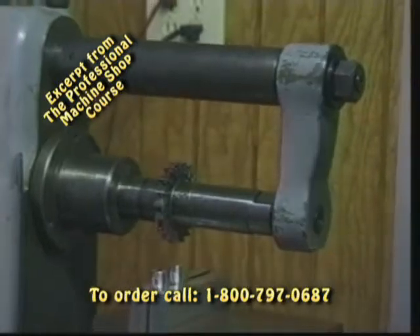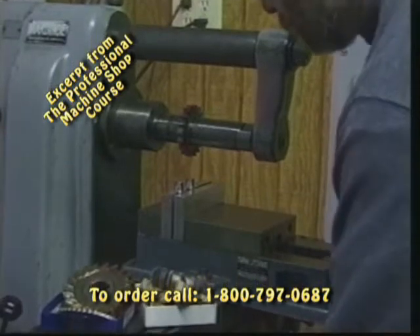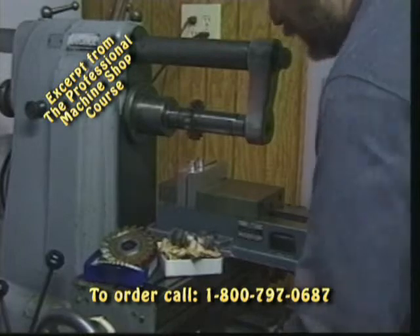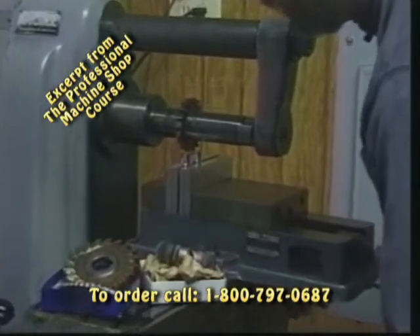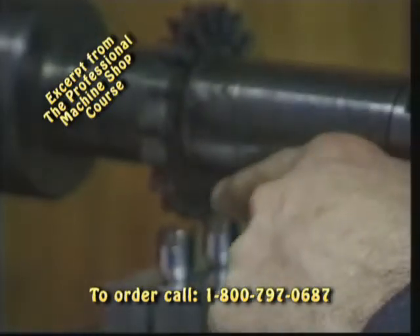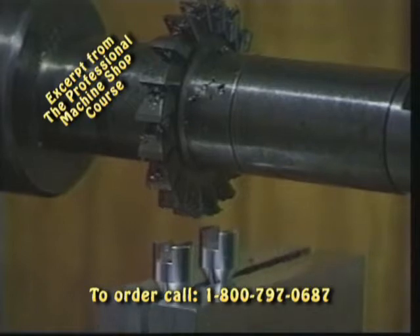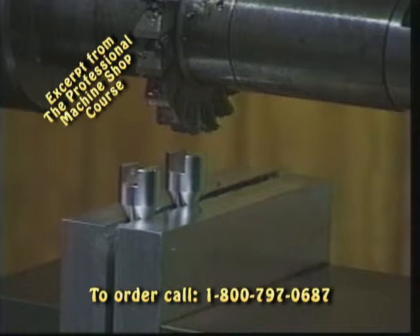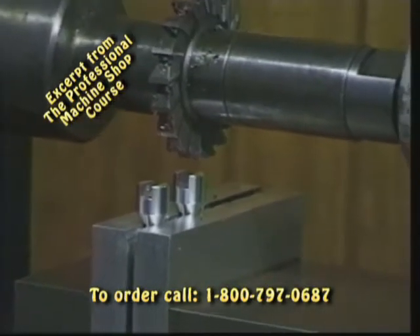The best way in aligning your tools with the horizontal mill is simply to bring the cutter up in contact with the workpiece, knowing the dimension of the cutter itself, and come in contact with an edge. We can't use an edge finder on a horizontal mill because we don't have a spindle to grab it. So we'd simply bring the cutting edge of our cutter up against our part, lower the bed, and then calculate the distance — the center of the cutter and the center of the part — in order to get whatever offset we need for milling that special slot.